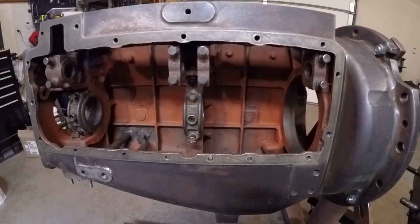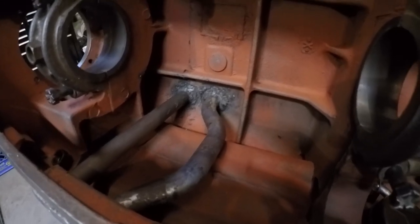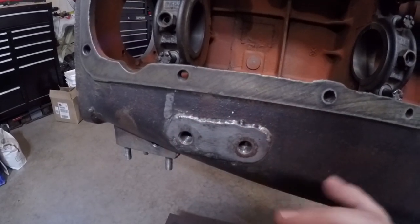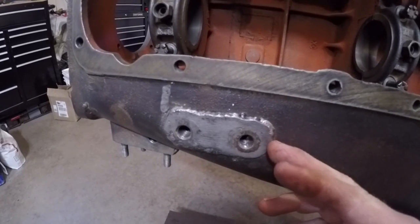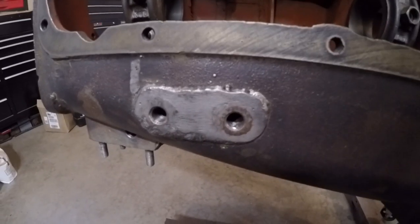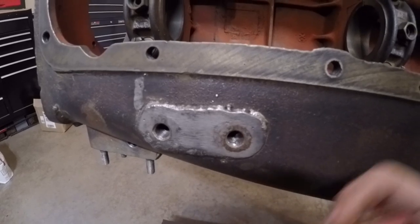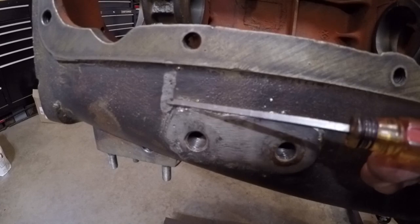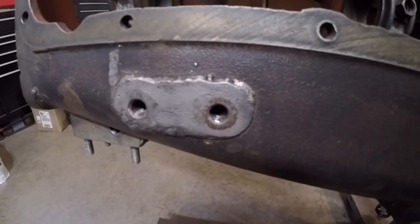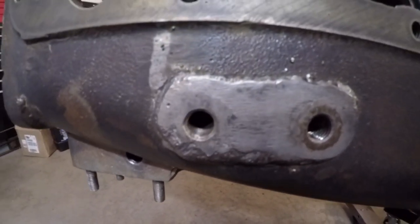If you've made it this far, you've probably noticed that X231's engine block has these rather rough looking bars that were crudely welded into the bottom of the crankcase. Those are reinforcement bars that are part of attachment points which they apparently decided to add after the block was cast. These became standard on 445s and many models after for implement attachments. They have a couple of threaded holes, and this one looks like they kept building up weld on the surface of the cast block and then ground it flat. There may have even been a small crack that started — that thin area of the block probably didn't like all the heat from welding. But it's all intact now, just kind of an interesting feature that was definitely added after the block was made.